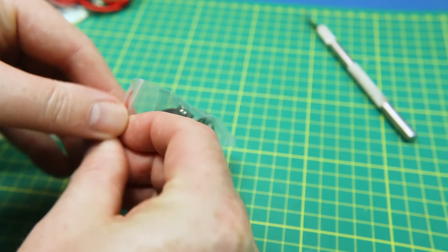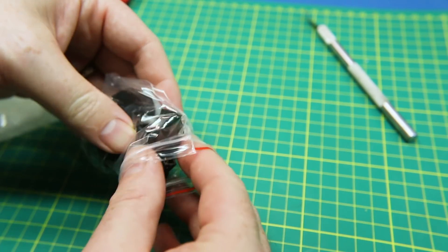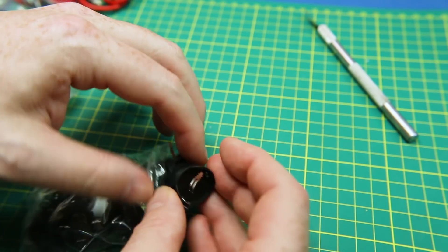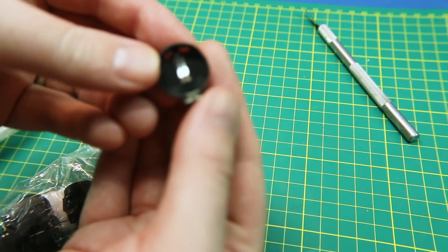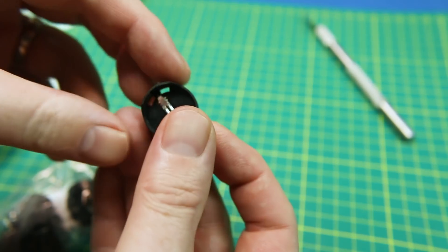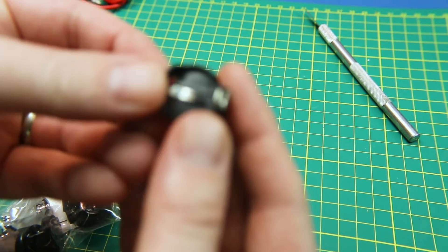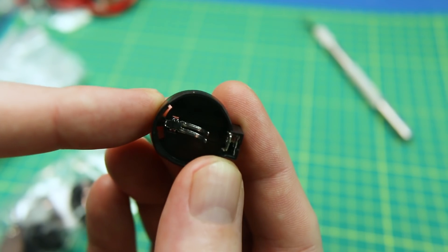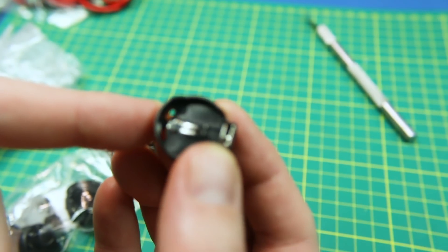These are some battery holders — coin cell battery holders for soldering onto circuit board projects. I think it's a 2032, I can't quite remember right now, but they're quite cheap and simple. We can simply stick one of these down on a small microcontroller board and power a standalone ESP8266 project — put it into deep sleep and run it off one of these for a while.